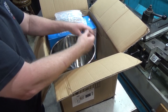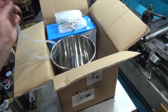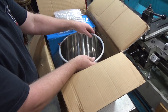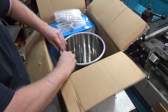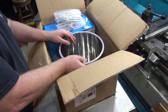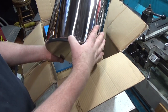They're planning on sealing silicone to silicone, so this has some sort of grid on it. I'm going to clean it with alcohol before putting it on because you want to make a good seal. After cleaning the gasket with alcohol, it went from smooth to sticky - apparently I took some oil off it too. Trying to rotate it around so it makes a good seal; it's a pretty rough gasket but I think it should work.